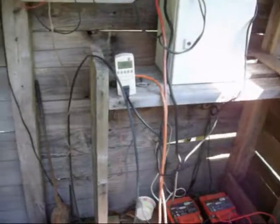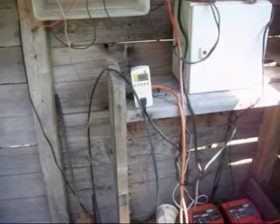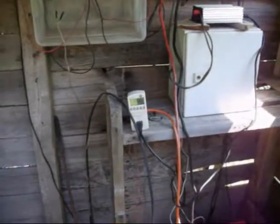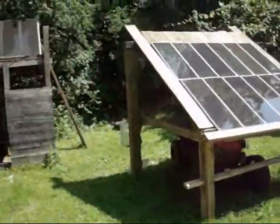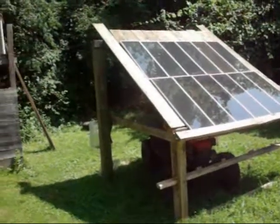What's bugging me is this thing is only reading 51W. It's bouncing between 50 and 53W and I don't understand why. Because last year I doubled up the panels on either side for 24V, and I had less panels and I was getting more out of it. Because it's almost noon, I should be getting at least 100W, even at 50% — but I'm only getting like 52W.